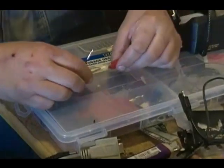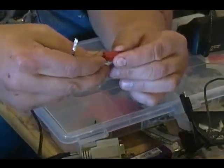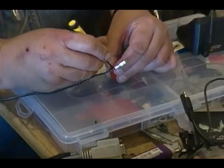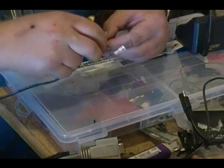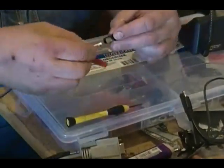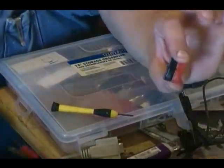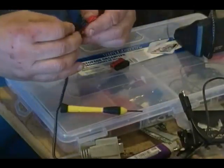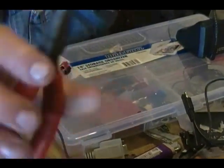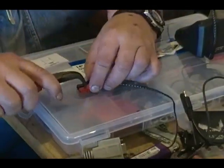Sometimes manufacturers like to throw a curve ball at you. See that little curved end — that curved end going down is what locks into the little spring metal inside the plastic connector. That plastic connector has a little piece of spring steel that the hook locks into. That way when you plug and unplug them, it gives it a wiping action — these are self-cleaning. Every time you plug in or unplug an Anderson Power Pole, it wipes the connection. Always keep one pair put together properly so you can make sure your positive and negative are lined up. Then take a pen or a toothpick, insert it in the little hole there, and that locks the two connectors together.